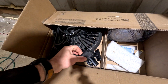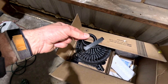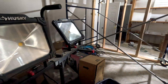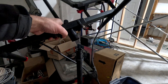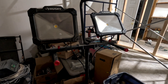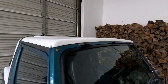I'm going to be hanging more high bay UFO LED lights in my shop, and I designed and printed these ABS eyes. I can clip each of these lights onto these support eyes, and I've actually made a lot of those - I'm using them in several different applications. Something fell on this LED light stand years ago, and I made this 3D printed mount to replace the broken piece. It's worked so well I've never had reason to find the official replacement part. I also designed and 3D printed these neat little Suzuki hood bumpers out of ABS. I attached them with stainless fasteners over a year ago and they still look perfect.